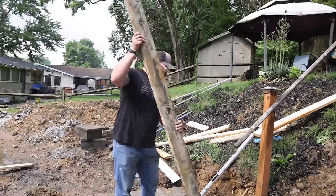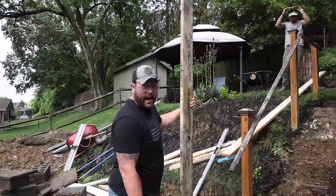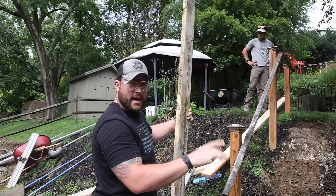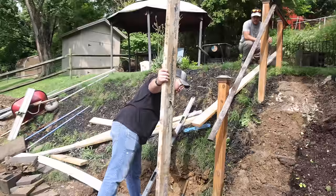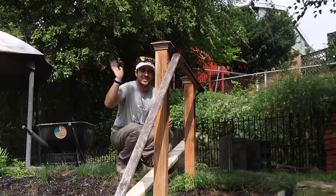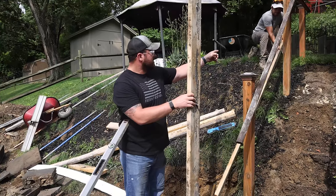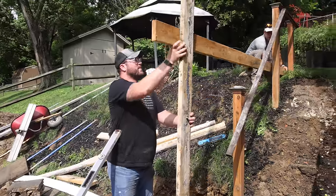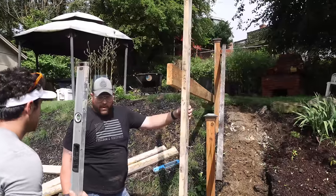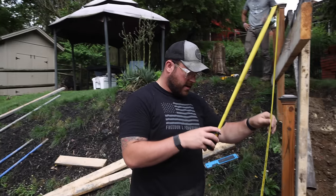The next thing we want to do is find the new rise and run. Our stairs are going to come down here and we'll use the existing patio as the base. What we need to do now is see how tall and how far back — the rise and the run of the entire layout — the stairs are going to be. I'm going to take this board and basically stand it up, get it as close to plumb as possible. Then we have Jordan at the top of the hill. He's going to lay the bottom of the board down at where we want the stairs to land, right next to that handrail. He'll bring me the board, level on it both ways, and we'll nail it in. Jordan will run up top and throw one in the post, and that should give us the overall height and distance of what the stairs are going to be.